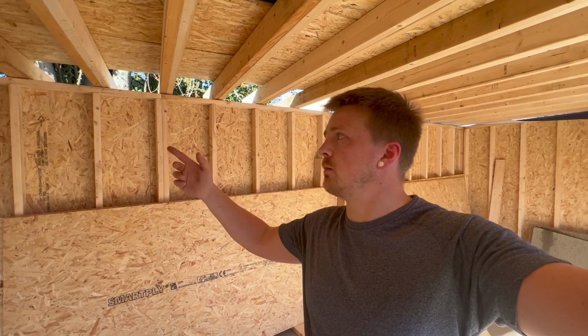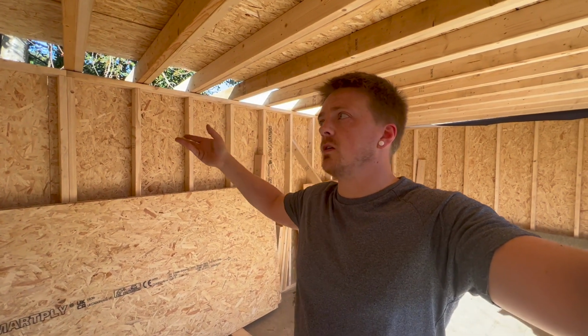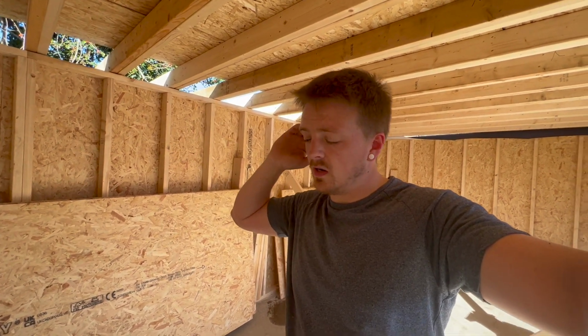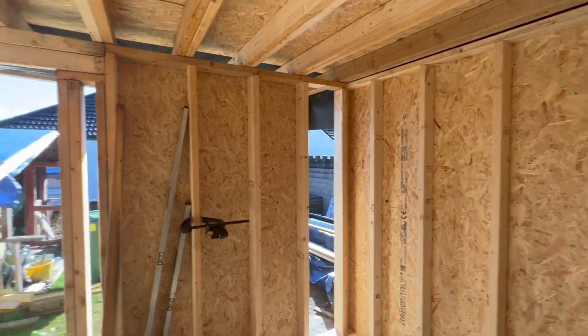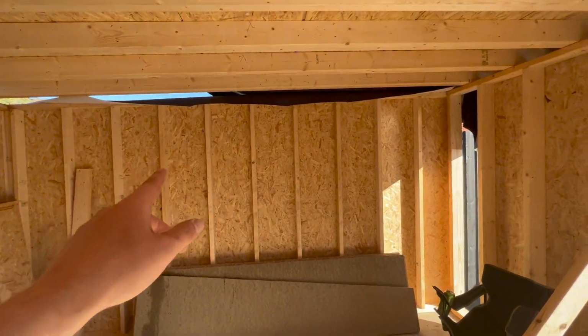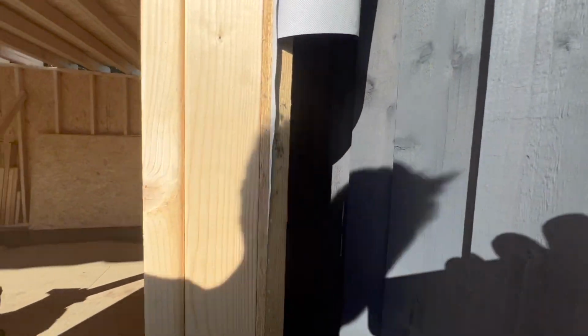So my goal today is just get that all trimmed back and the timber cladded on, get the roof wrapped under and create a bit of a sag and drip so the water just drips down. And I'm hoping to board there, board there, board there. I'm leaving the board off at the front here because this external wall and that back wall need painting with fire rated paint. Now, this is the gap I got.